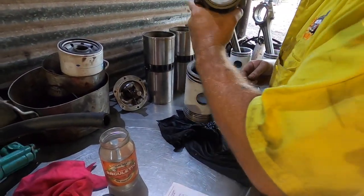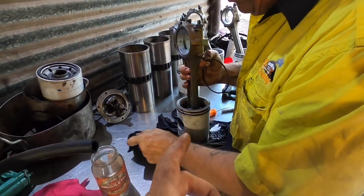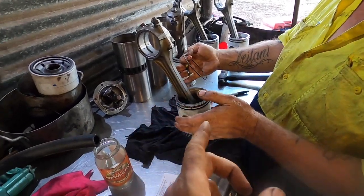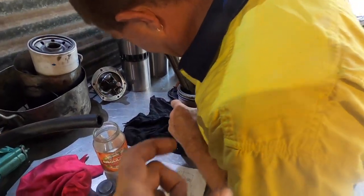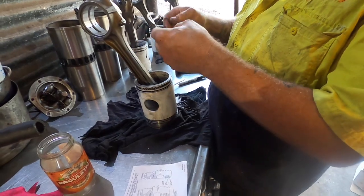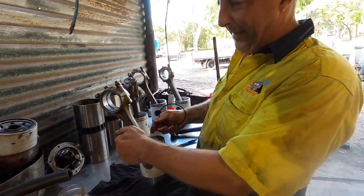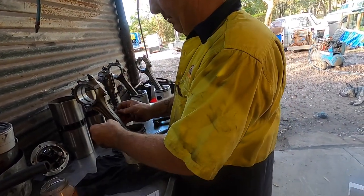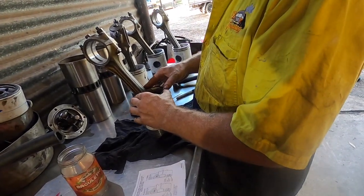I used to just spin the piston. So you initially had the gap for the expander to one side, it doesn't matter which side, then one oil ring that way. Your oil rings are 180 degrees apart, and when we go to put them in, they'll be 180 degrees apart on the other side as well. Just work them over there, they'll come over nicely.